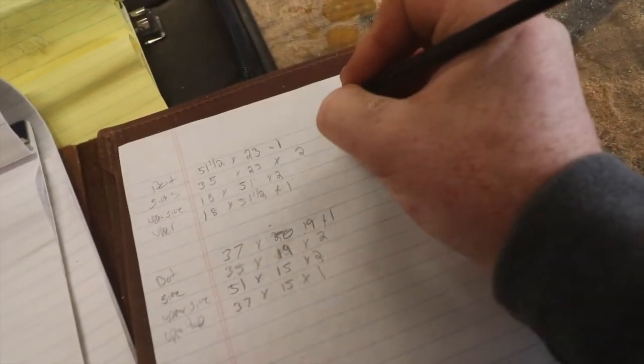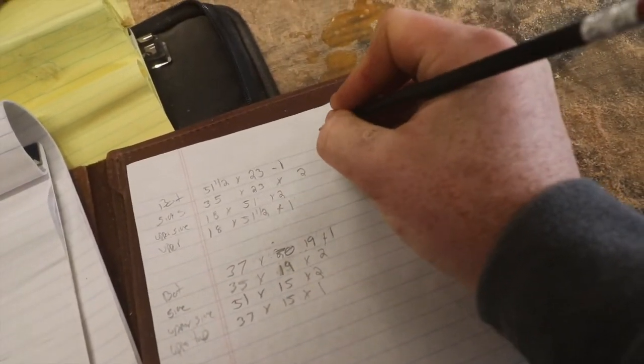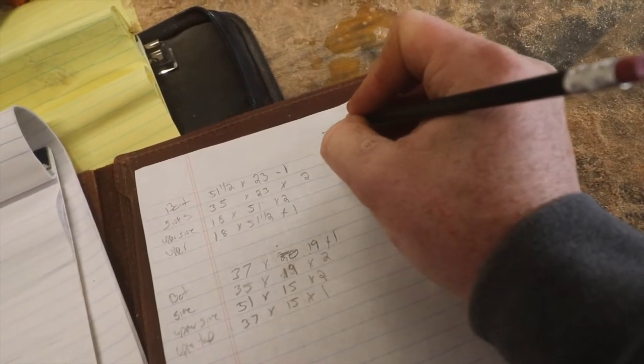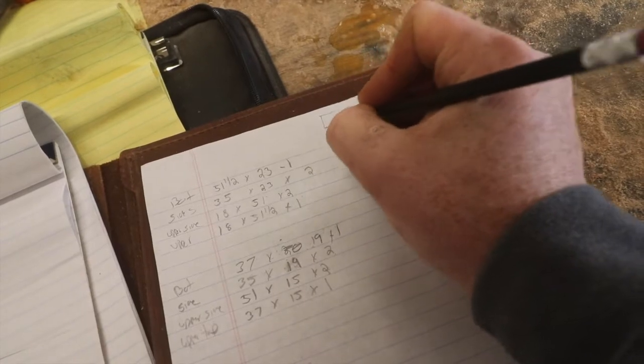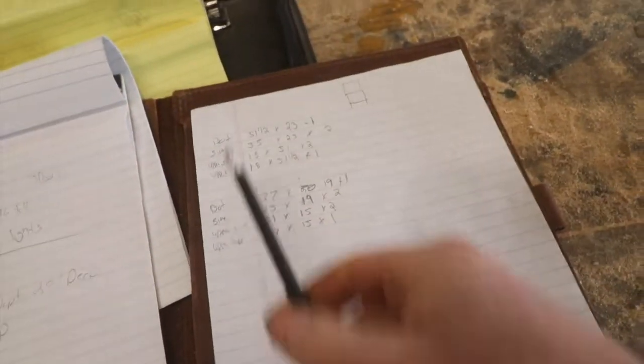There should be 6 panels for each one. You got your bottom, you got your sides. This is just a stretcher. Then you have your top portion. Then tops 1, 2, 3, 4, 5, 6, because there's 2 units. The biggest thing I used to screw up on is forgetting to deduct your face frame. That adds three-quarters to an inch of wood, though in this instance it wouldn't matter. There's going to be no back, so I don't have to worry about rabbeting.